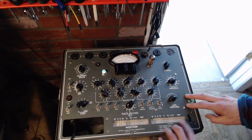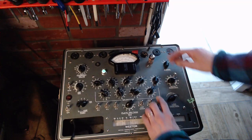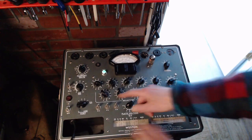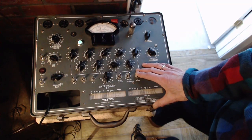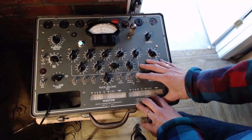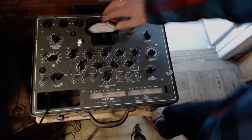So this is a dual tube, or twin tube. 1250, so check them out here. Oh boy. Okay, that's way over 1250. The other half of the tube, we just do that. Give it another run. A little weaker, but not bad. Well over the reject point. So let's do this again. There we are. My poor tube tester, I've worn them out. So 1180 and it's up around 13, so not incredibly strong, but certainly functional. Okay, right in the same area, 1170, right up here.